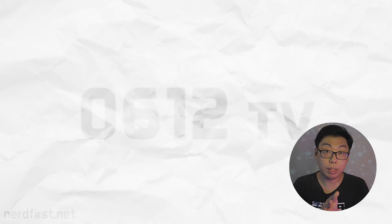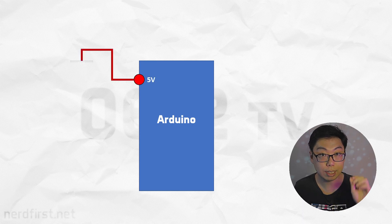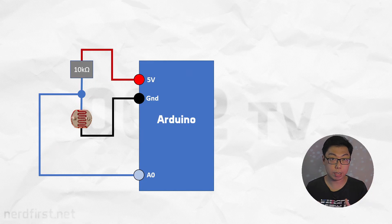To do that, I went for an RGB LED — essentially three LEDs in one — which I could flash red, green, and blue as needed. With that and a photoresistor, I'm practically ready to get started. Here's the physical layout. I'm using an Arduino as the brain of the entire setup. I have a photoresistor connected as part of a potential divider. This causes the voltage to change as the light level falling on the photoresistor changes. If you want to find out more about this phenomenon, we've discussed it previously — link on screen.